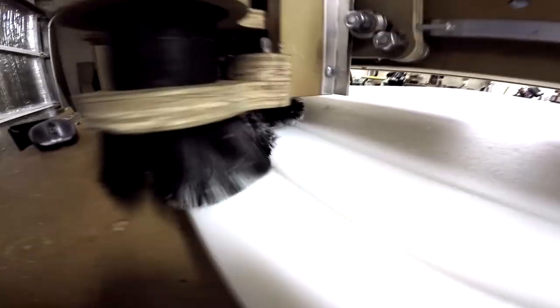Right now, what we're doing here is testing, because we've never machined HDPE before. We don't know what the machine will do on HDPE. We've done many materials with the GreenBull. We've cut aluminum and obviously wood. We cut acrylic all the time, and acrylic is actually kind of difficult because it can gum up if you go too slow. It is a thermoplastic, which means that under higher temperatures the material can melt. A thermoset will just become brittle if it gets too hot. And HDPE, because it's not a cross-linked polyethylene, is a thermoplastic, as far as I know.